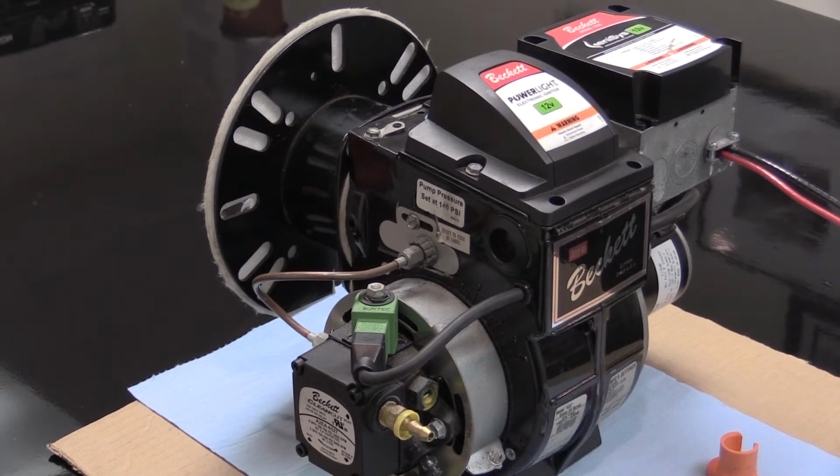The main hopper burner and the second burner that is connected to the hopper, you do not need to remove these burners from the combustion chambers. If you are pulling a burner maintenance on the tack tank burner, that burner will have to be removed from the tack tank in order to get to the nozzle, the electrodes igniters, or the CAD cell eye assembly.